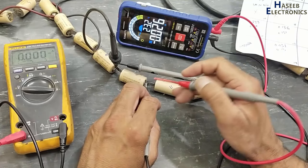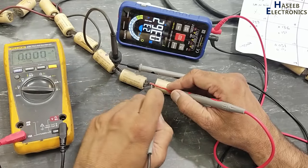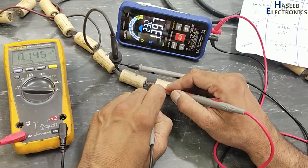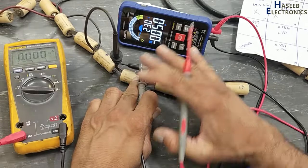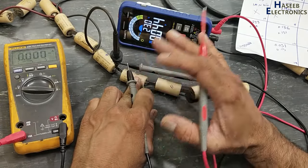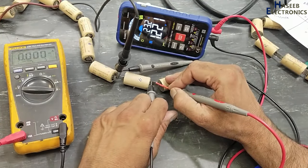Let's check it again. Battery number 10. Voltage 0.35. Now I will connect the power supply. Yes — this is bad response for any battery. When we connect the charger, this battery will stop the charging current for all batteries because its internal resistance has increased. Now we will check battery number 11: 1.2 V — current is within range.